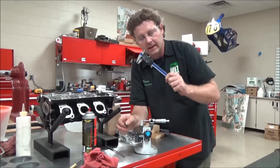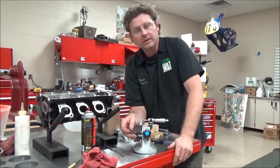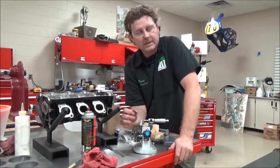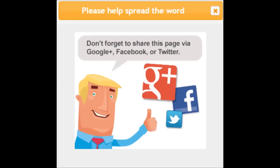You go in to do the feeler gauge and you're like, 'What's going on? I measured this — how can this be off?' You're probably using the wrong tool. We do not want to use a vernier caliper in this case; you want to use a micrometer and use the right tool to get the job done the right way. So there's my tip of the day — keep wrenching. If you like what you see, please share it. I'd love to keep my platform going for technical education and the ways to be great in your craftsmanship. Keep on wrenching and we'll see you again. Thanks for being a subscriber.